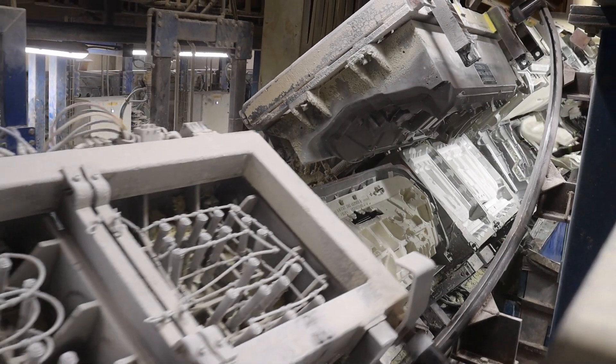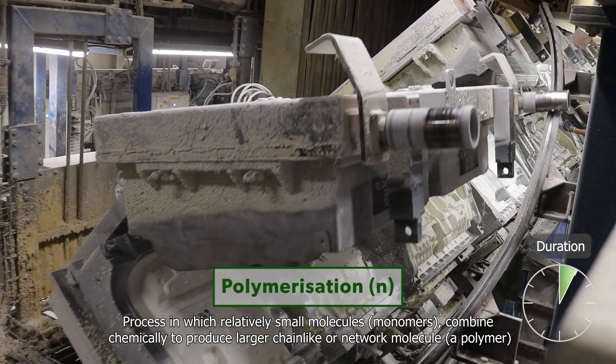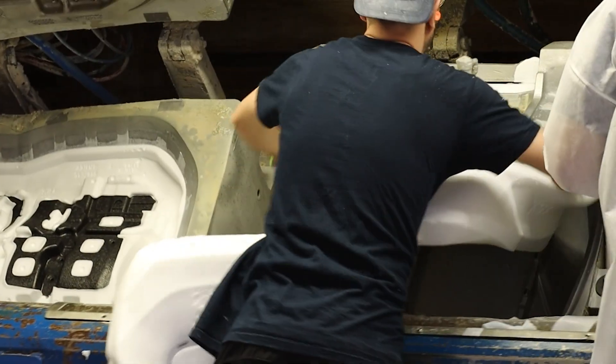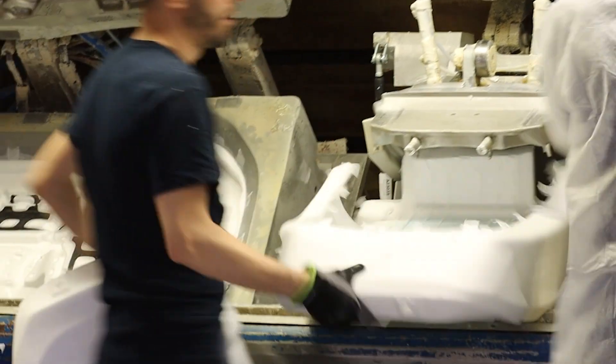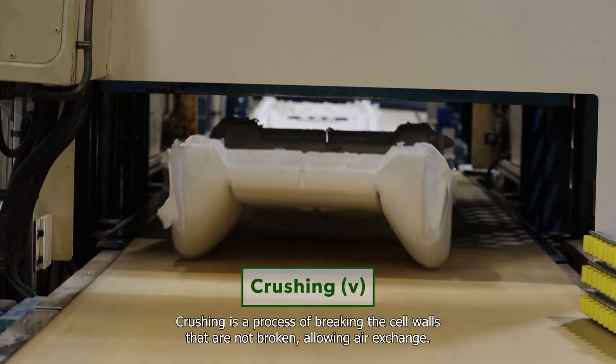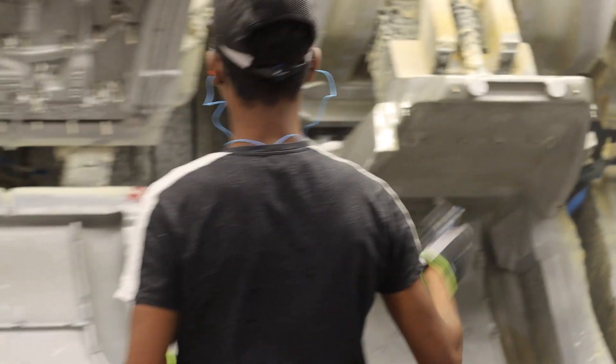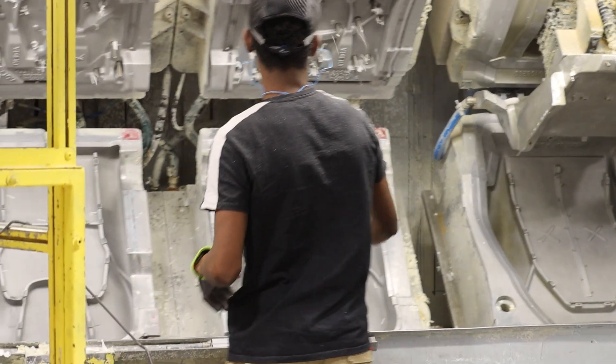The quantity of injected liquid has an effect on the final density of different sections of the seat pad. At the end of the production line, once the polymerisation process is finished and the seat pad has solidified, the carrier is automatically opened and the finished product is removed, either mechanically or manually. The finished seat pad is then crushed in order to open any remaining closed cells, while the mould is cleaned and prepared for the next iteration.